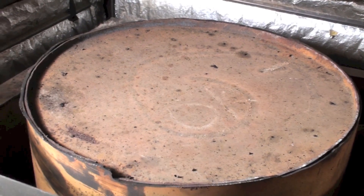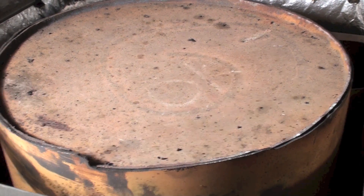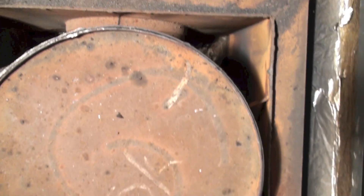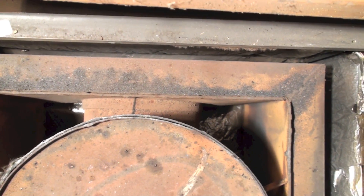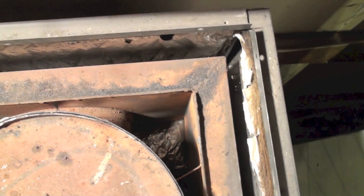From that vent collar you can see in there — it goes around the central heat exchanger and the central combustion chamber. Now up above, that's the combustion chamber there. This unit doesn't have any ductwork on it so you can see the heat exchanger — that square thing that goes all the way around. From above: there's your combustion chamber, a pipe comes out the back of it, and there's the heat exchanger going all around. It's fairly simple.